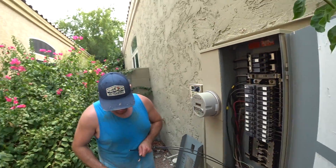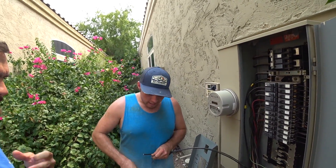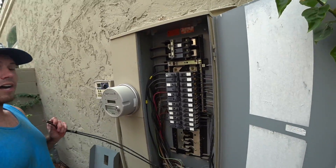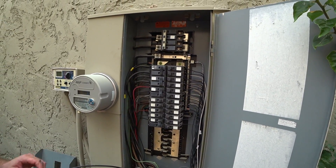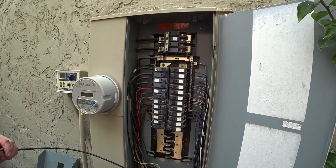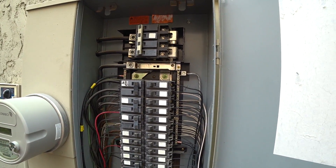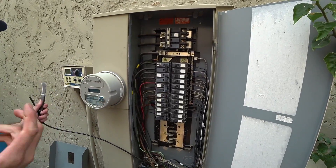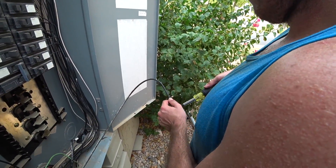You're going to see uneven loading especially in older homes — this house was probably built in the 70s or 80s. Back then they didn't know. If your box looks like that, don't take the time to fix it, it's not worth it. But what I would do for peace of mind today: pull the breakers out, look at them — does that bus look okay? You can shut them off, pull them out, see what it looks like. If it looks okay, you're fine. So same process in here — you're clamping those exposed copper wires down.